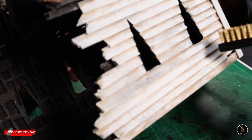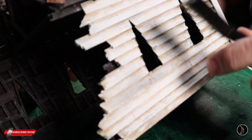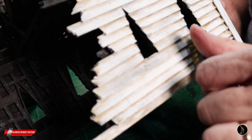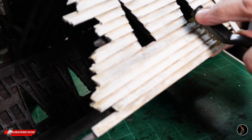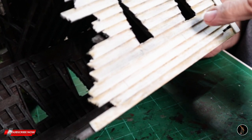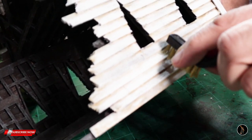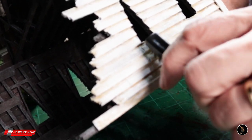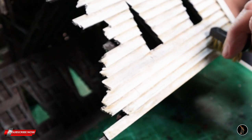When I first did this I asked some family and friends about it and they didn't think it was distressed enough. So now I'm going to come through and distress it with a wire brush. I don't really want to do the typical scraping — I kind of want to pepper it a little bit, just dig into it and give it a little chipping. I want to keep it to one panel at a time so each panel looks consistent, because the wood underneath is going to behave differently.